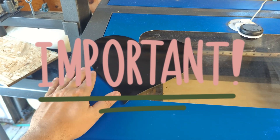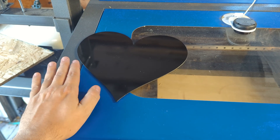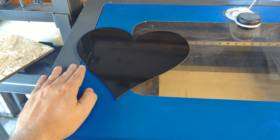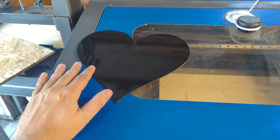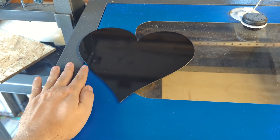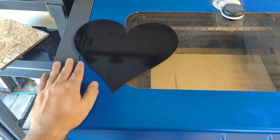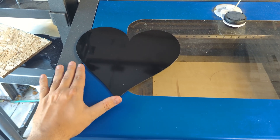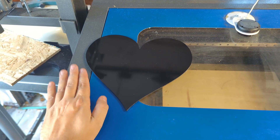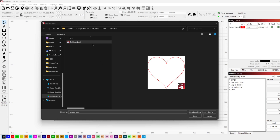The most important thing I've found is that you let the paint cure for at least 24 hours, if not longer. I personally go two to three days. If you try to engrave before the paint is fully cured, it starts to melt instead of vaporize, making a terrible mess even with all the surface prep. Do not get in a rush — do not wait until it's dry to the touch and immediately put it in the laser. Let it dry as long as you can before engraving.